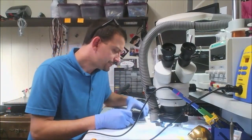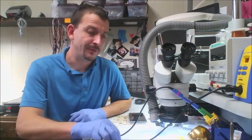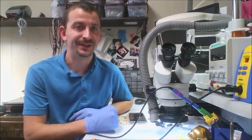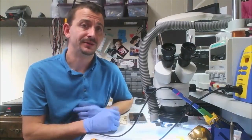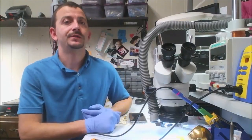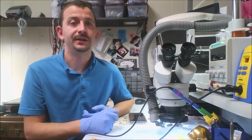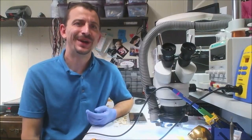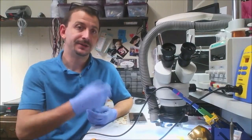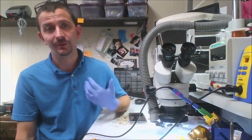So this is another successful iPhone 6 Plus Touch IC replacement. This one involved micro jumpers. Sometimes I feel like those pads come off the board so very easy that there had to have been a micro tear there to start with. But if I was opening up this phone, another tech had worked on it and failed at getting the touch IC to work, and I opened it and saw missing pads, I'd say, oh, well, that guy tore pads. I can blame the phone all I want, but the reality is I took the chip off of it. There were missing pads after I removed the chip. It's kind of hard to deny I'm the one that tore the pads.